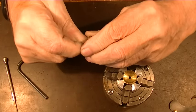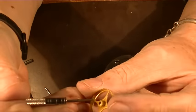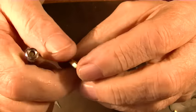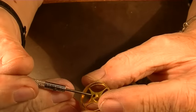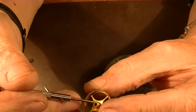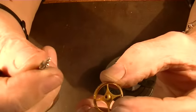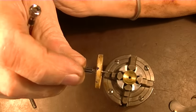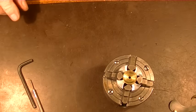It jammed on there. Hold on. There. This part right here, this hub, we have to make that, right? And then we have to bore out this hole to, actually we'll probably ream that because it's so small. We'll ream that hole to press fit on this arbor. Goes on like that. Okay? So that'll be part two. This is part one. I'll see you next time around.